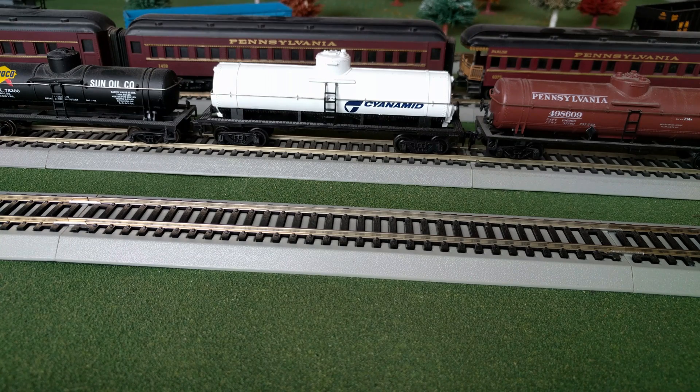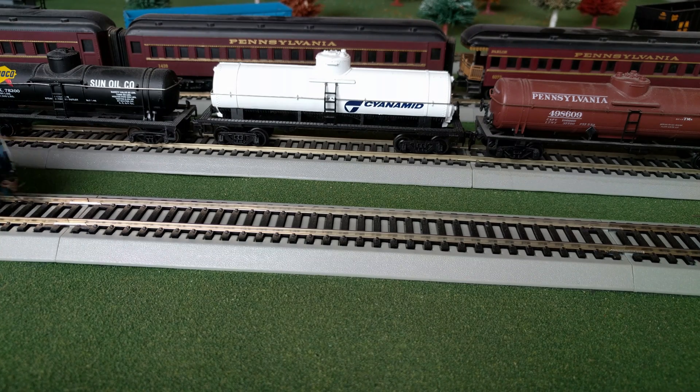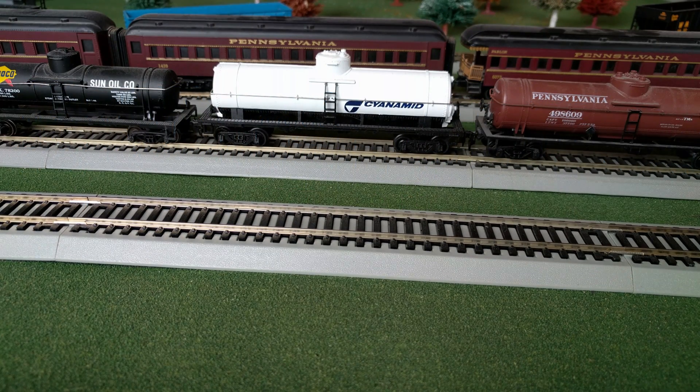So the next thing I'm going to do is disconnect the power and move it over to my service track, which is independent from everything. Because if you do any changes like this, all your DCC switches will get all crazy and everything kind of resets. So this way it's only talking to the decoder and the DCC loco.